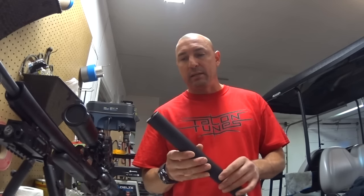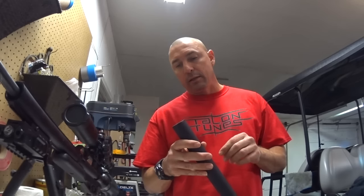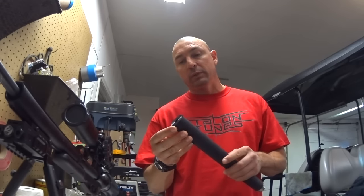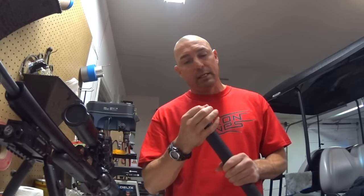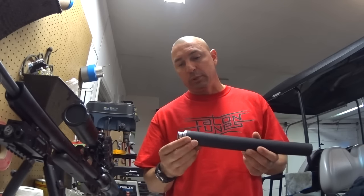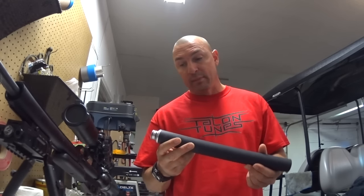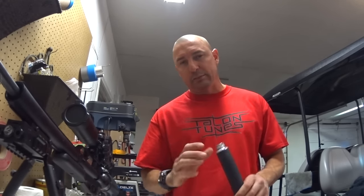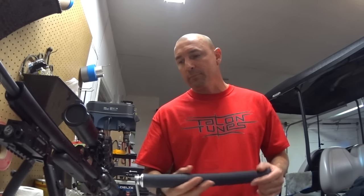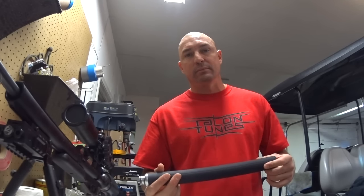A couple of changes he's made on this one versus some of his other ones: the front cap is actually pinned or screwed on in some of them, but he's completely epoxied this thing all the way around on the front end to make it basically one solid piece. The rear end is still held on the same way and I believe it's epoxied as well. The fit and finish is very impressive — double O-rings, a little bit of airspace around it. We're definitely going to see what we can do to get this thing just a little bit quieter, running 3000 PSI to see if we can get below 90 decibels.